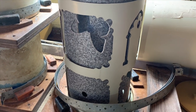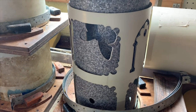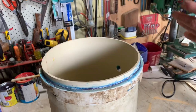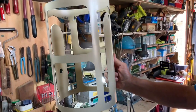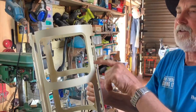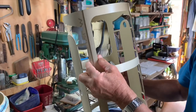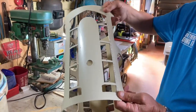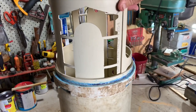John explains the mold process: the vinyl transfers onto the plastic to form the mold — two parts, with the outer plastic part and the vinyl on the inside to create the pattern. Everything is made upside down, and the hardest part is thinking in reverse, because everything you cut out will project out of the face. It's easy to get mixed up and cut the wrong way, meaning you have to start again from scratch. The vinyl makes the pattern as a combination of the two.